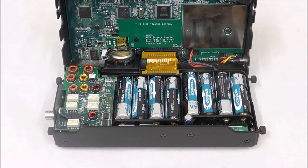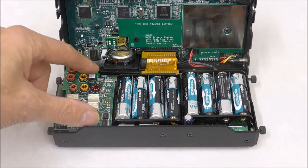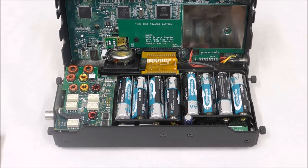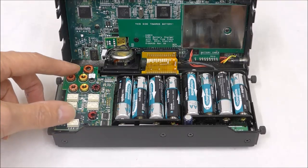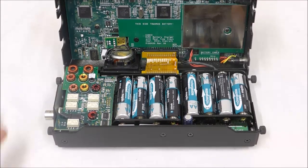One of the popular items to fit — in fact the most popular item to fit into the KX3 — is the AutoATU. This is the AutoATU here and it literally plugs in. It's a board about 4cm by about 3cm thereabouts. It just plugs in, held in with a couple of screws. You just have to remove the antenna lead from the main RF board and then re-route it onto the top of the board. It's that simple.